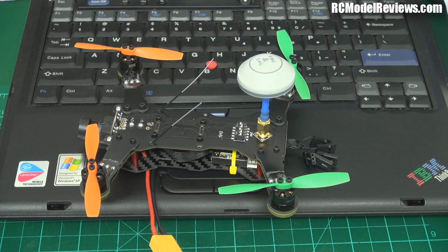That means anything I want to change on this board I've got to do through the command line interface, then power down the mini-quad and power it up again before it will talk to the computer again — it's just so crappy. I've finally got the CC3D to work, but it was such a battle. Even tuning the PIDs is not going to be easy. Let's hope the pre-tuned version of this controller actually works as it should. It's all set and ready to fly. I'm charging an 800 milliamp-hour battery.